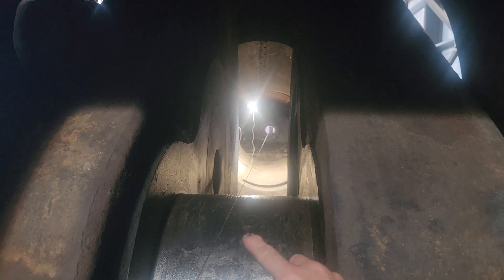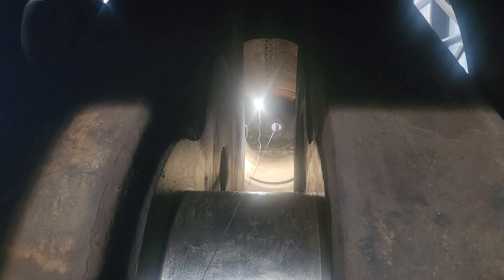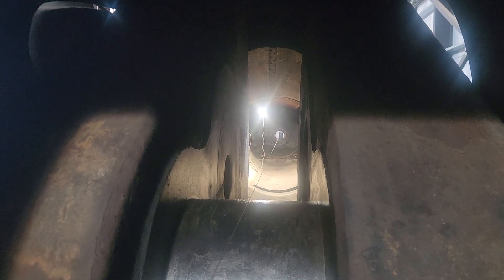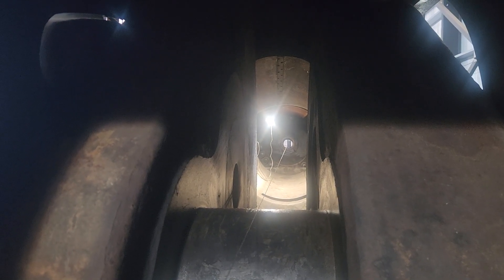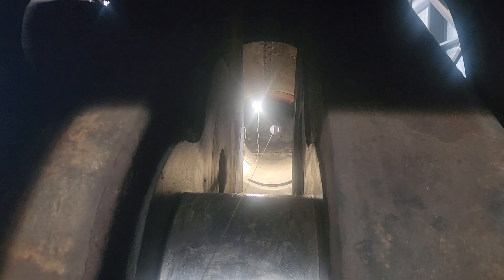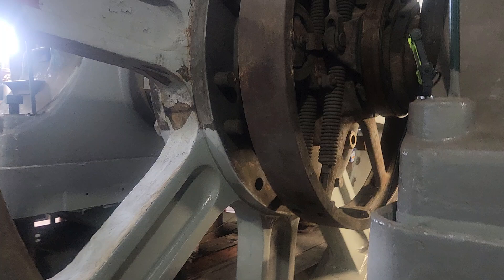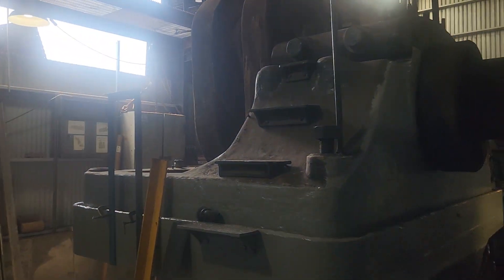However, when I do this I get like five and three-quarter on one side and six and a quarter on the other, so it's a little bit crooked. It's sitting out a little bit. That's the whole thing with getting the steel brackets and the hydraulic rams — lifting the crankshaft up out of the bearing far enough so we can move the entire high-pressure bed plate over a little bit until it lines up straight, then set the crankshaft back down.